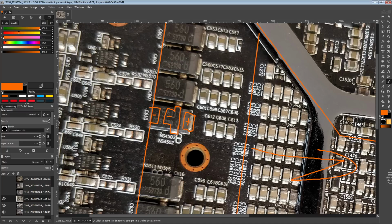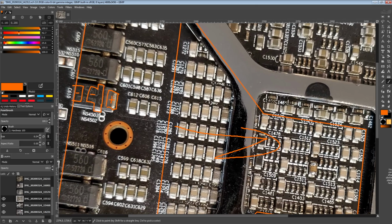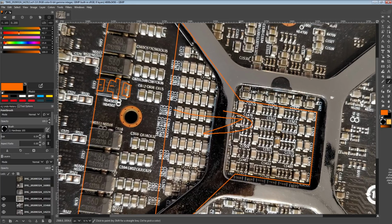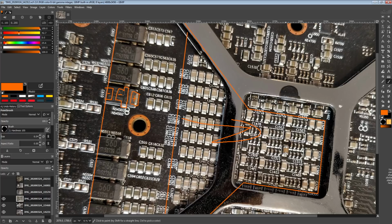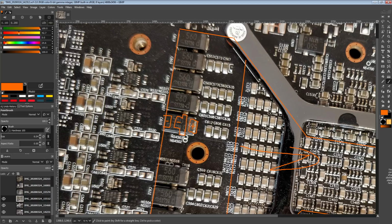It basically means the capacitors are even better at filtering out high-frequency switching noise. When the GPU core suddenly wants a lot of current really quickly, the capacitor is much more able to provide that current than if it had a much higher equivalent series inductance. So this is a really cool type of capacitor for filtering the power supply for anything high frequency, like a GPU core, that also pulls ridiculous amounts of current. Also, they come in really low ESRs. The downsides: they're extremely expensive. I'm not sure on the specifics, but getting specific price points from hardware manufacturers is basically impossible. They don't really share them with anyone.